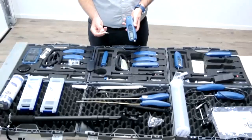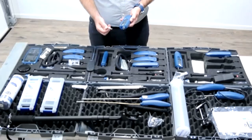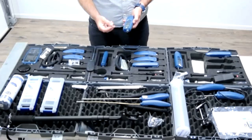So what's the go with your hygrometer probe? Can you get different hygrometer sticks? We've got 3 different types. The one that's used for standard is the 16K25, meaning that there's no filter grid or filter foam insert. It's just the sensor behind this metal cage, meaning that the air will flow through quite quickly. The meter will adapt quicker than with the other ones.